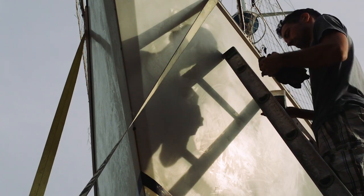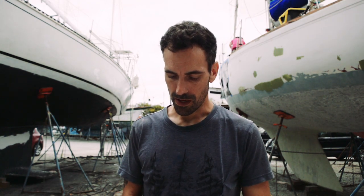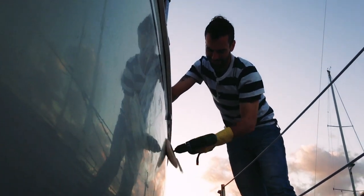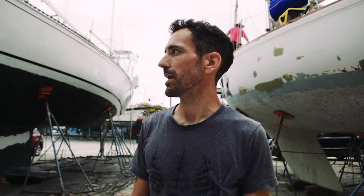I went back and dug out an old wax I had in the boat and gave that a try, but ended up throwing it in the garbage because it was turning my gel coat beige. There's a difference between polishes and waxes — polishes remove the grit and dirt and prepare the surface for wax. I know Total Boat actually has a polishing product as well, but I'm really just interested in waxing right now. The gel coat's not that dirty, I just want to protect it. Last time I had another wax — more like a car wax — that I could buff with a buffer. I may have to run out and purchase something like that, but I'm going to give this Total Boat product a try first.